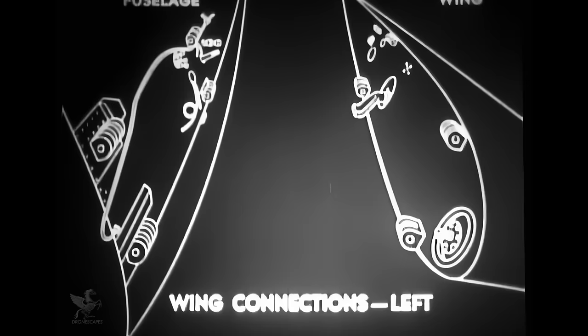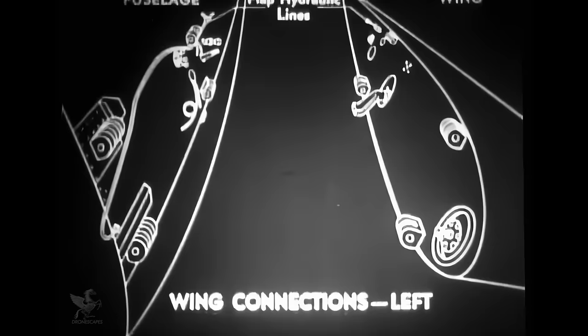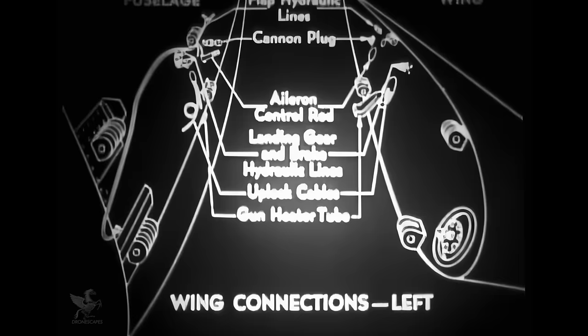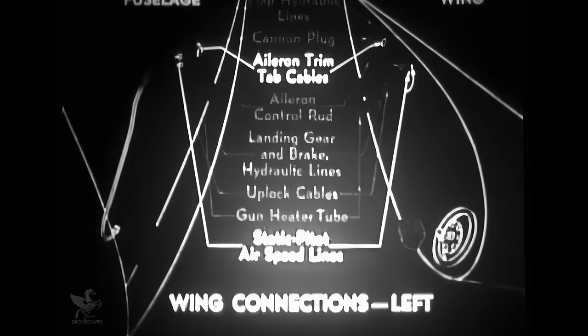Here are the connections which are found in both wings: the flap hydraulic lines, the cannon plug, the aileron control rod, the landing gear and brake hydraulic line, the uplock cable, and the gun heater tube. Now let's see the connections found only at the left wing root. They are the aileron trim tab cables, the static and pitot airspeed lines, and the oxygen line.